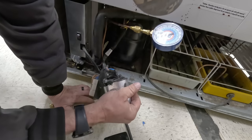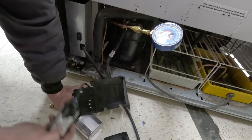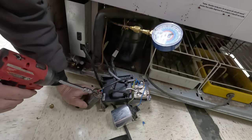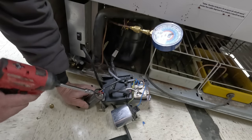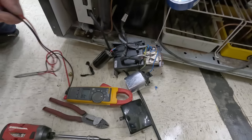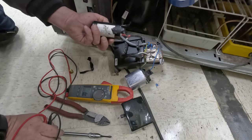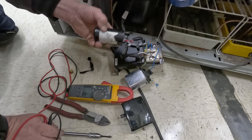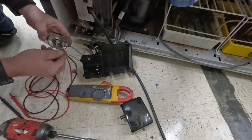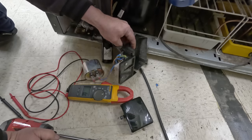She is hot to trot. There's the start capacitor, which is nice and hot also. No bleed resistors. Let's short this to make sure, because I'd rather it blow the compressor up than shock my crap. Check the obvious crap first. The start capacitor comes in at 93 microfarad, and this is rated for 88 to 108 — so that's not a problem. It is rated for 25, so we have good start components. Except we don't know how the relay is, so let's take a peek at the relay.